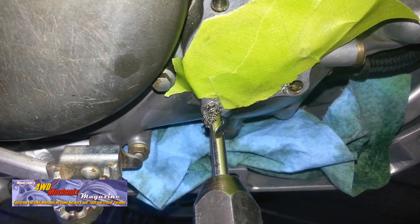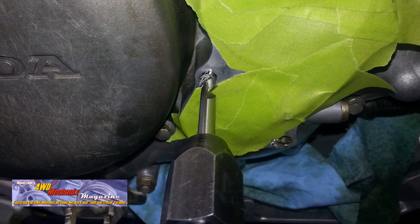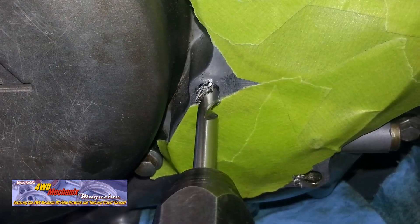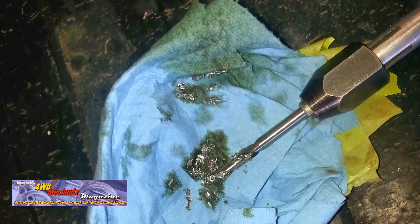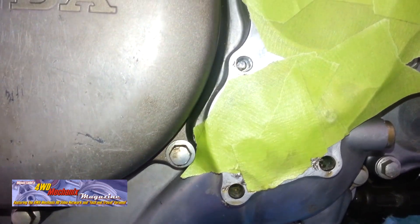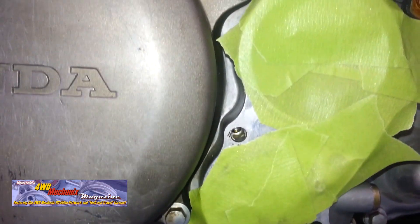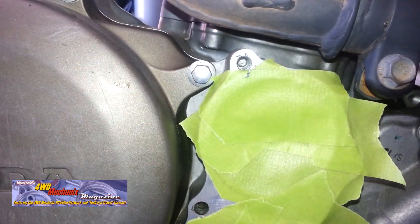This is aluminum and cuts easily. Clean the drill bit after drilling each hole. Force is applied evenly and great care is taken to keep the drill on center. This aluminum will be replaced with a stainless steel high tensile strength insert. The drill has removed approximately 18 millimeters of blind hole threads.